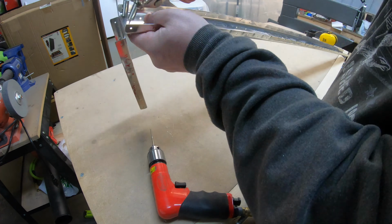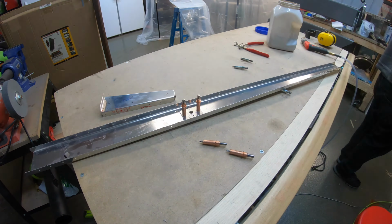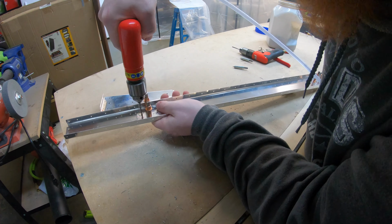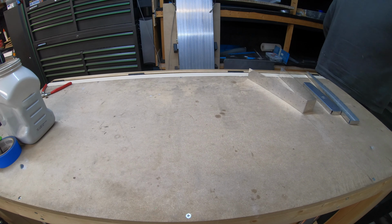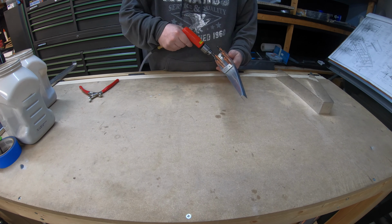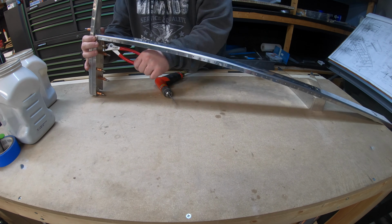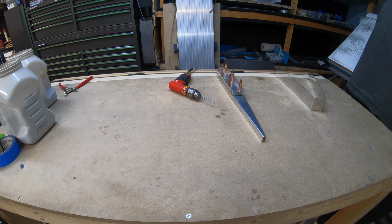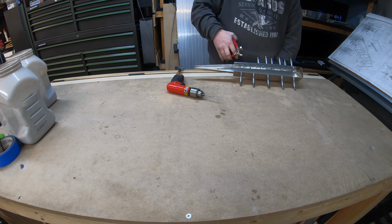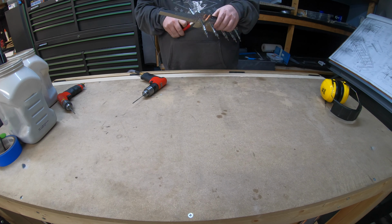Now we're back onto the spar, looking very similar to the right elevator, just getting those doublers on and the reinforcing plates. Now working on the counterbalance structure and clecoing it onto the rear spar. It's going to allow us to, again, final size all these holes. Fairly straightforward, standard assembly at this point in the process.